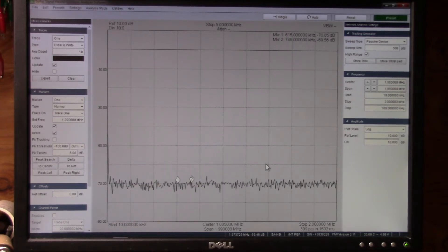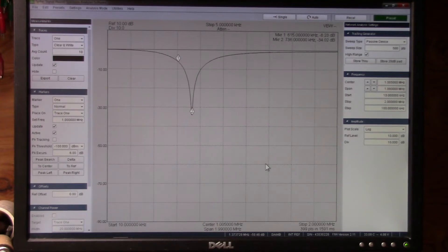It's going to drop again to the bottom. I'm going to be adjusting the knob here. Marker 2 is at roughly 736 kilohertz — I just tuned it to that frequency. That shows about 35 to 36 dB of loss. Now I'm going to take the core and push it in. This is sort of like a ferrite loop stick, but try buying one with the exact values you want — everything here is handmade. As I move the core in, you can see the notch moving lower in frequency.